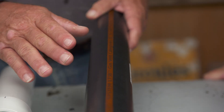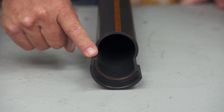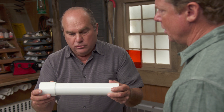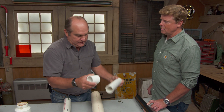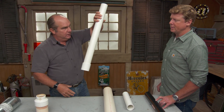The other part of the standard is that both the pipe and the fitting should be manufactured by the same manufacturer. Here's an example — this is two different manufacturers. You see how loose this is? Now you might be able to put enough glue in there to make it work, but you don't want to rely on the glue. You want the fitting itself to be tight, because we want it airtight. This is the way it should be.